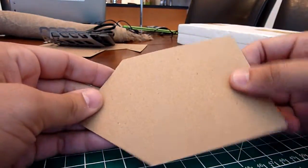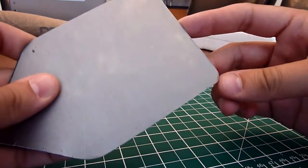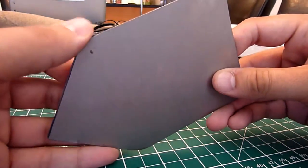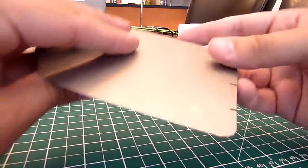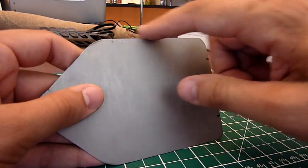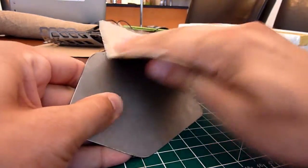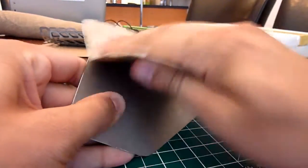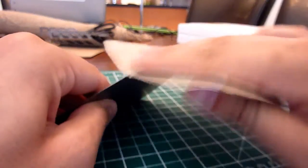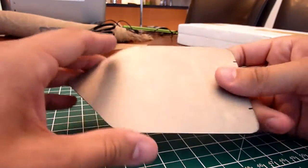Once complete, you're going to remove your profile. What you'll want to do is smooth the corners out a bit — it's going to help you from catching your gloves or any clothing on there. And as soon as you've done that, you're going to see it's a little bit rough. You're going to want to take your sandpaper on both sides. It's going to leave a nice smooth edge — make sure you do that really well all the way around.